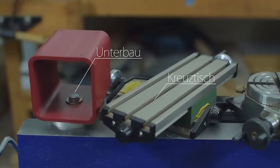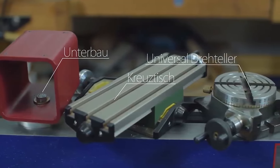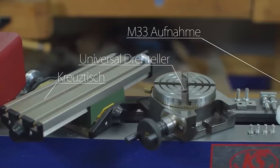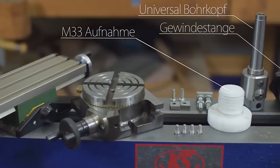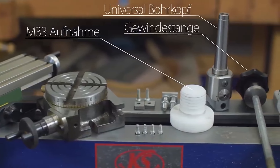These are the parts for the ornamental turning device. On the left we have the substructure that clamps the turning device to your lathe bed and gets it to the right height for your spindle. Second is the XY cross slide and that looks like an off-the-shelf cross slide. The third item is a small rotary table which can also stand up on its end. The white part is an adapter that bolts to the rotary table and the chuck screws onto the thread. The last two parts are a small one and a half inch boring bar and a tie-back for that boring bar.